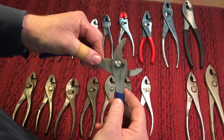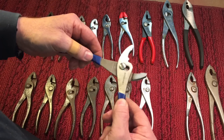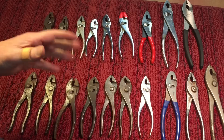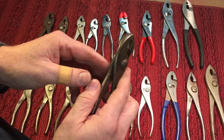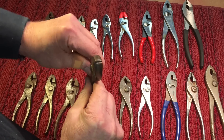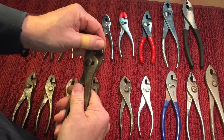The plier is not really meant to be squeezed at the top — where you really want to see the slop is from side to side like this. That's how tight this nut is. You want it to operate smoothly without binding, yet still not have a lot of slop. This pair doesn't have a lot of slop, believe it or not — it's actually pretty decent. But pliers like these are made to be adjusted as they wear over time. You don't get too many of the bolts wearing down, but sometimes the inside surfaces tend to wear a little bit. When you pick up a pair of pliers, the first thing you do is go from side to side to see if there's excessive movement. These CT pliers are nice — there's not really excessive play from side to side.